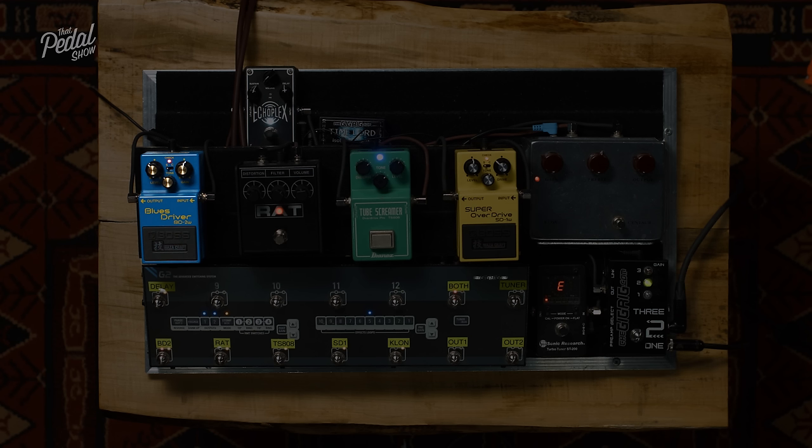And that gives us stability of the signal. It helps keep things clean. It helps with distortion. So what we're going to do, instead of having those diodes directly on the output, is put those diodes in the feedback loop.